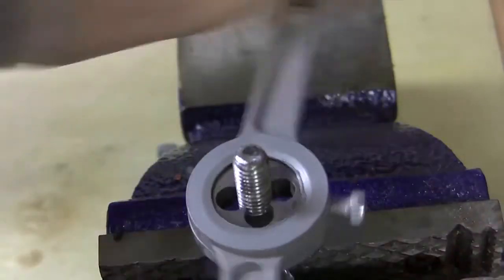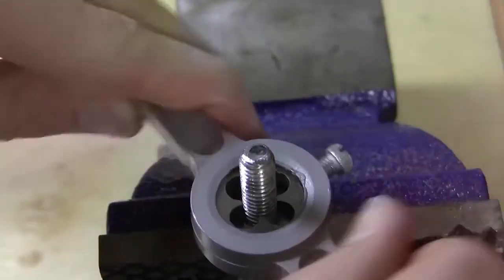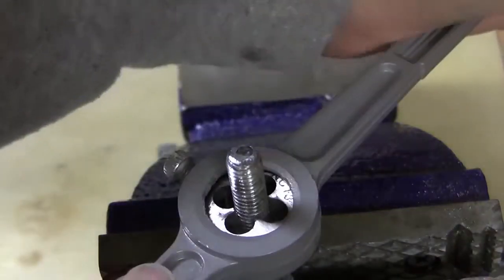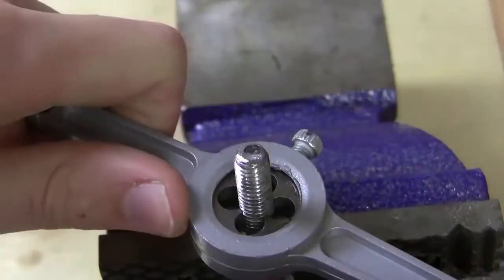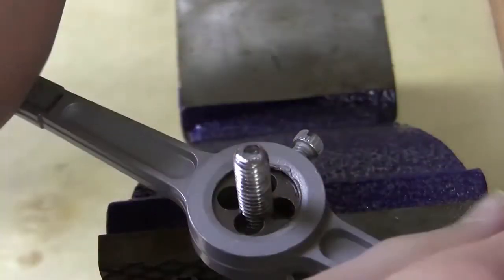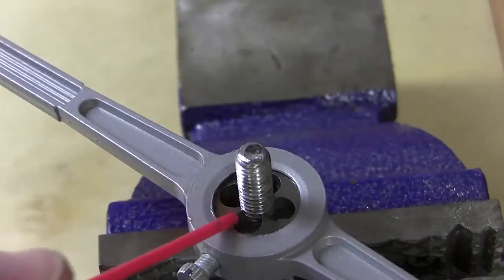Right now I'm not really cutting anything, but I still take a few turns, then cut the threads by going back. The threads are getting shinier. Let's apply a little more oil. I'm going to take about a quarter to half turn, then turn counterclockwise to break and cut the threads. That sound is when I was just cutting them. This is steel, so these are pretty tough.